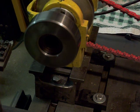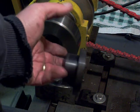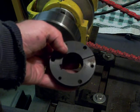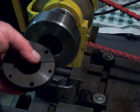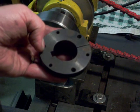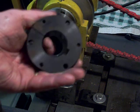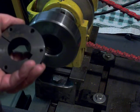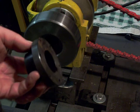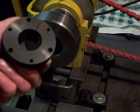As I said, it's a collet chuck, and what are used for collets are these bushings that are used to hold sprockets and pulleys on in an industrial application. This series is the SDS series and you can get them in sizes from half inch up to two inch. The thing with these is they're not really that expensive and you can kind of consider them consumable. You can bore them out to whatever size you need for a specific odd job, and if you have to do repeatable work it'll hold each piece true every time.